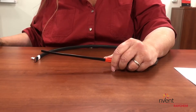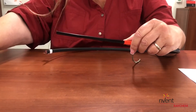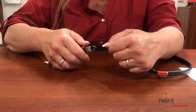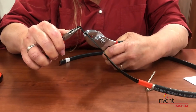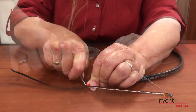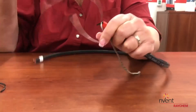Next, in steps 4 and 5, you will be removing the black semi-conductive core, exposing 6 inches of bus wires. Follow the instructions in step 4, notching the black core at the end with the diagonal cutters, which will help you start freeing the first bus wire away from the core. As shown in step 5, be sure to score between the two bus wires at the point where the inner jacket starts. This will help you remove the core from the second bus wire.